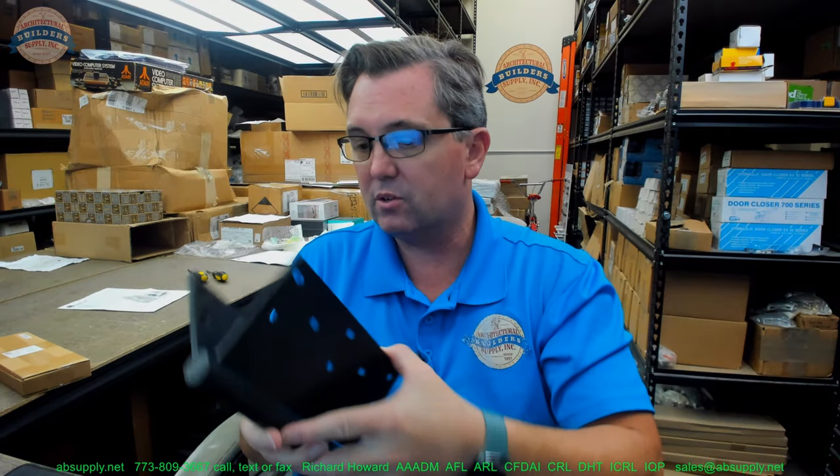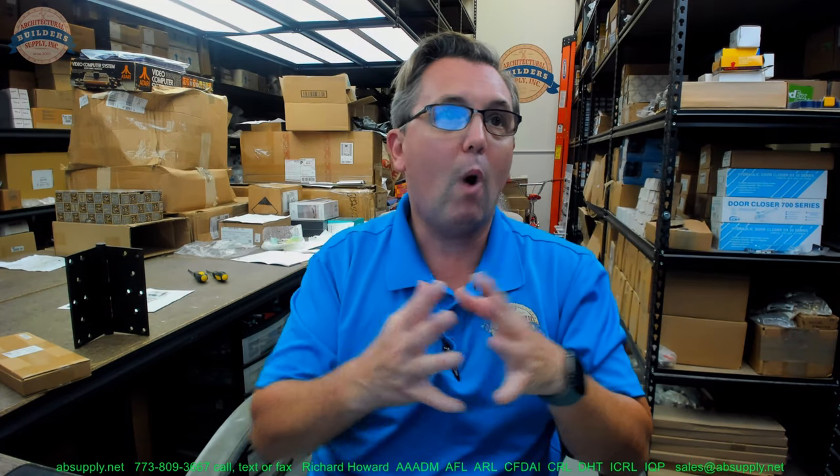Now, where would you use this hinge? I did say that it was brass — and that magnet confirms it's not made of steel, or even stainless for that matter. Stainless would be marginally magnetic. Where would you use such an epic hinge? Well, obviously on a door that's incredibly — most likely very wide — and the 8-inch height relates to the potential weight and width of the door that the hinge can handle.